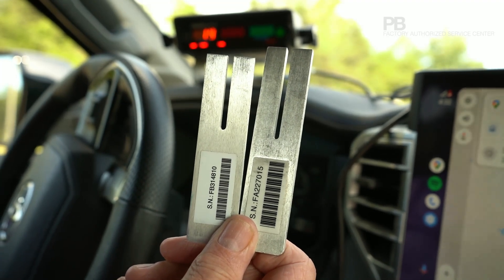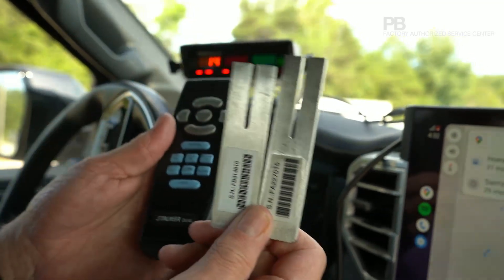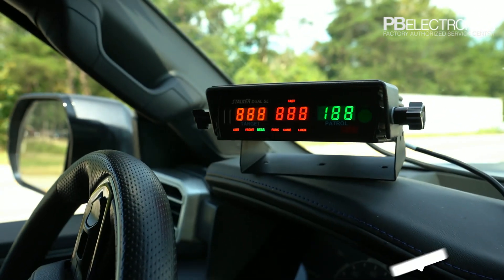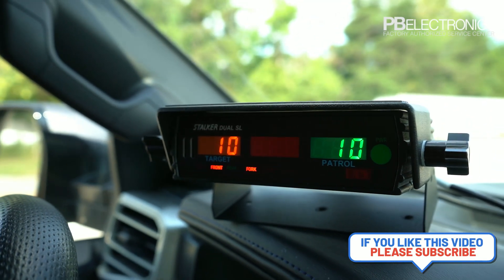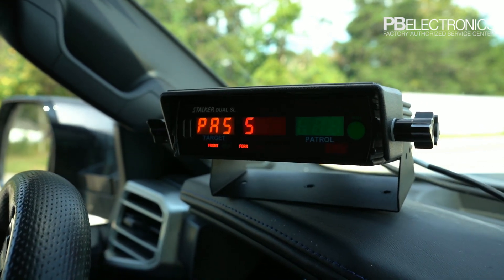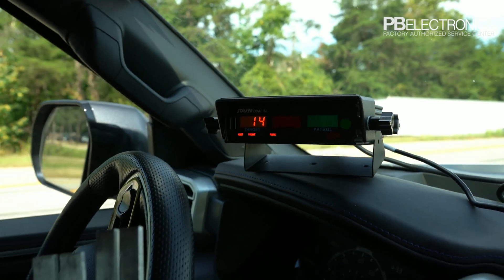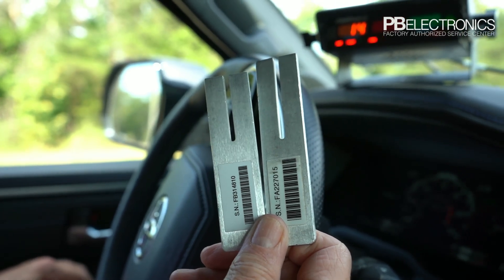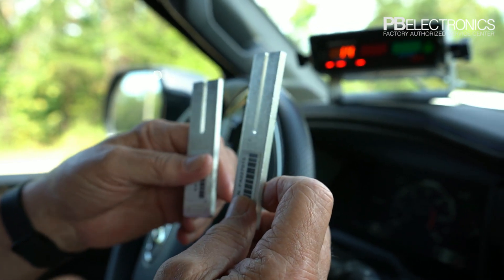To prepare a radar for measuring tuning forks, the first thing we do is make sure the fork mode is on. You can see it there — I'm going to reinitiate it and the radar says 'fork.' Some radars don't have that and will read forks no matter what, but directional radars have to be put in fork mode in order to read a tuning fork. Without fork mode, you may or may not get a reading.